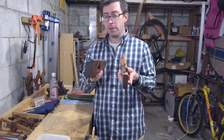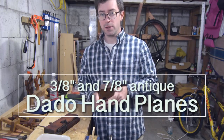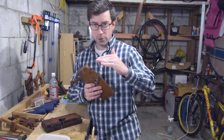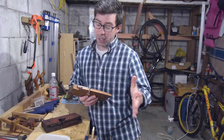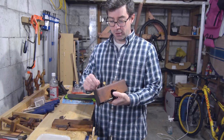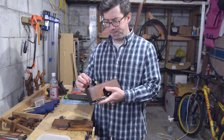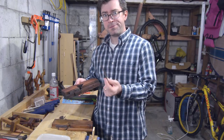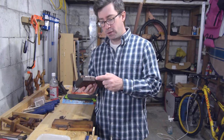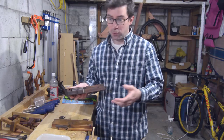This episode we're going to be fixing up these two dado planes. This one I can tell was definitely used a lot. It's chipped out, and this iron has a convex curve on it which means it was even sharpened by hand. This one's about three-eighths of an inch. This guy is completely missing a wedge up here. They bent the iron, the knicker iron, so that it holds itself in place. The iron on here looks to still have a factory grind on it.